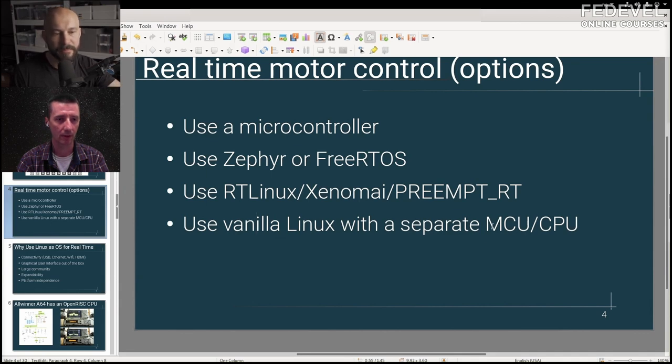Which approach are you using? The final one — you send commands to the microcontroller which handles the real-time stuff. All the rage these days is a controller software for 3D printers called Klipper. There's a separation between the path calculations and the step/direction generation — it follows all the physics involved.